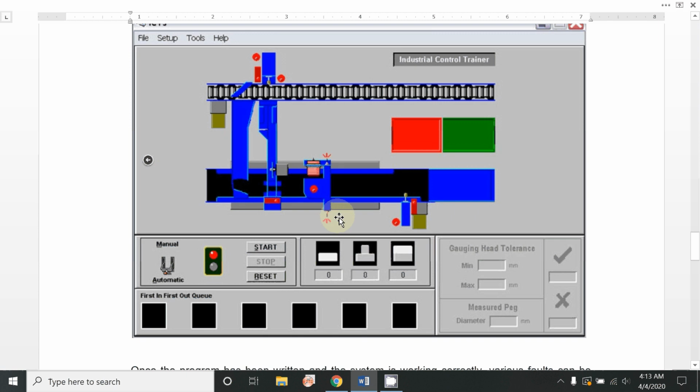And the third one is a capacitive sensor, which is used just to check the cross-sectional surface area of that assembled part. If the plastic ring at a specific height is perfectly assembled with that, it will allow it to pass. Otherwise, it will further come and will be rejected by this solenoid valve with a simple push, which will be detected by using this infrared sensor.